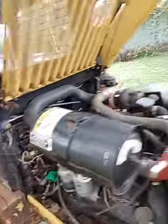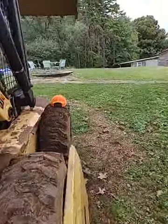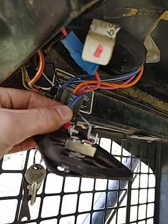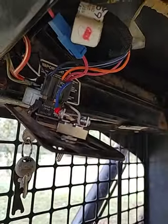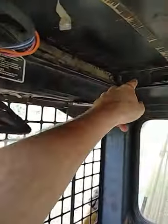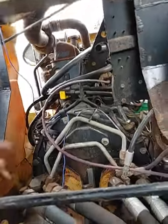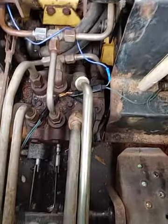This little red wire I just have run to my electric fuel pump, so power is coming from here across the window, over there, up and into the cabin to the switch. Now the blue wire on the other side of the switch is what's going to run power down to the solenoids — the interlock solenoids down here. I routed them the same way across the top, down the back, and it comes down the back of the firewall.